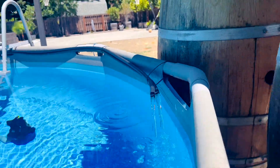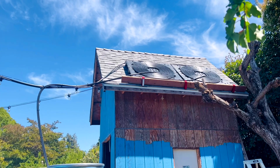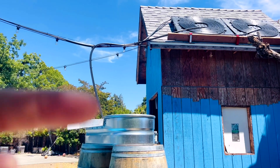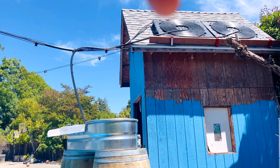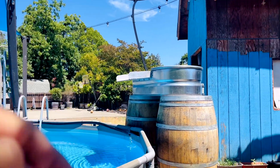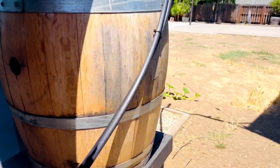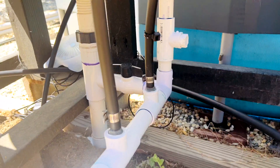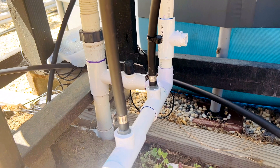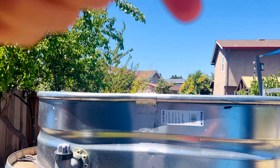So this is the finished result — let me explain. There are the two solar heaters on top, which are fed by this here — this is the feed going up into the coils, up and over the top, comes down, up over and into the pool. I can run the feed two different ways: I have it hooked up to two of these outlets here if I need to increase the flow, or I can take them apart and just leave it running on siphon.